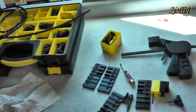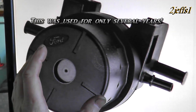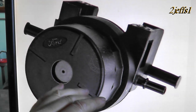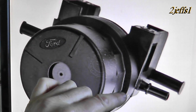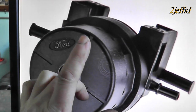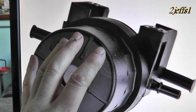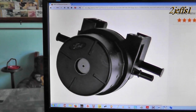I thought I'd come in your office here and get you a picture of something that is optional on my truck, pretty much so since it was new. This piece here went inside the frame — it was a fuel accumulator, air-fuel separator, yadda yadda. The fuel filter is inside of here. You had to unscrew this; a little tiny O-ring was always a pain to get set back in properly. I just didn't care for this design. I had a customer vehicle that was a tow-in, and good thing you do a little testing — you would have thought the fuel pump was bad, there was no pressure. The guts came apart inside of this thing. So my truck no longer has this in.